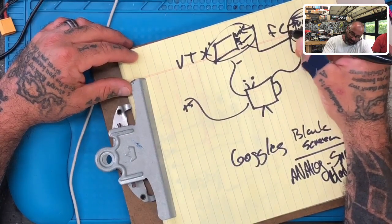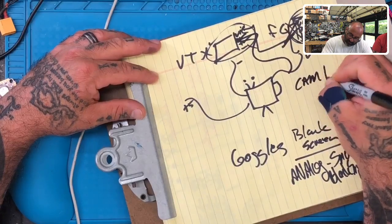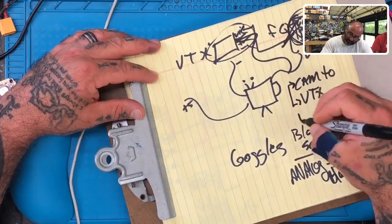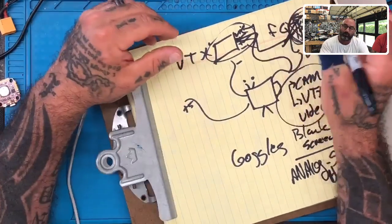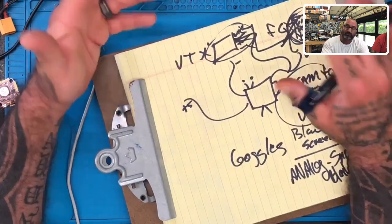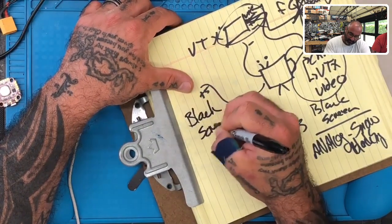What you want to do is cut your video in and remove your video out from the FC, and take the camera and go directly into the VTX — skip the flight controller altogether. See if when you hook those up, do you get video? If you get video when you go from camera directly to VTX, then you know the problem is somewhere on the flight controller — could be a bad pad, could be dual camera mode settings. This is how you test if your VTX is good, especially if you don't have another drone to test it on.